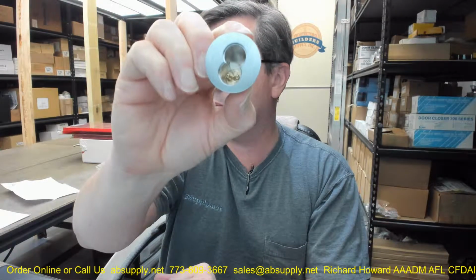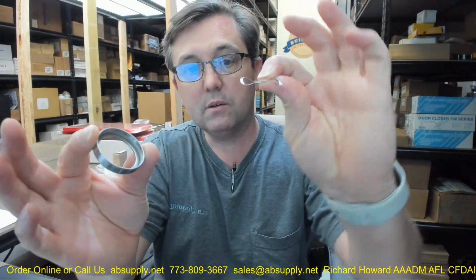In this video, I want to bring you a closer look at the Schlage 80-101 with a B520-296 cam in 626 finish. This is a mortise cylinder housing, less the small format interchangeable core, for Yale. So what we have here is an 80-101, and an 80-101 is going to include the compression ring and spring. We call this a wave washer as well. If you've ever heard the term wave washer, this is what they're referring to.